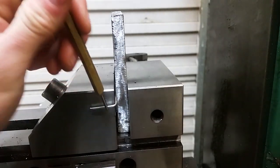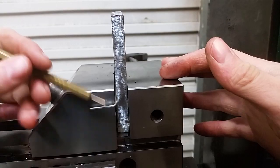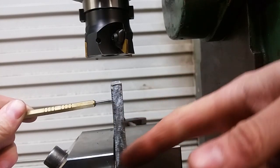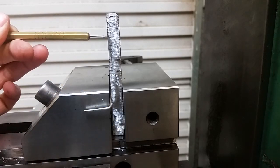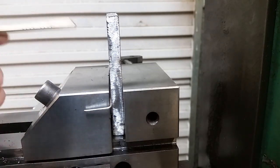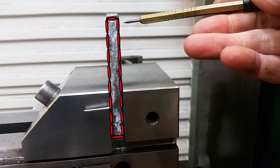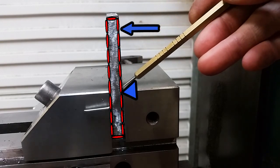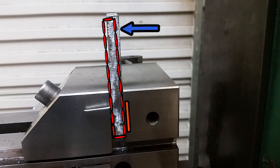Having this wire in here creates other issues. Even if we use a face mill with forces going sideways, a high impact force can cause the whole plate to rotate about the wire. Because there's no support underneath, the plate will vibrate and chatter with each cut. However, if we're smart about our feed direction we can get all the load hitting on one side so the plate rotates against the fixture and is pressed firmly up against it, giving us a more rigid setup.